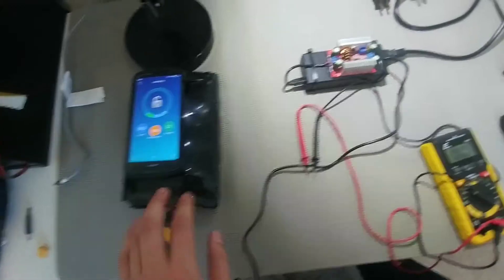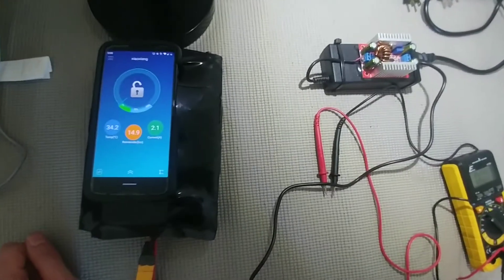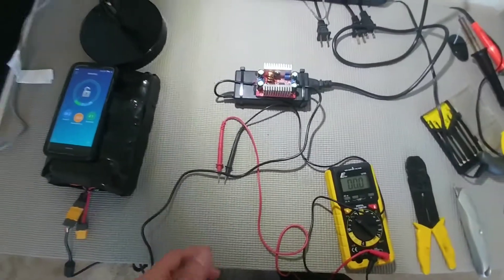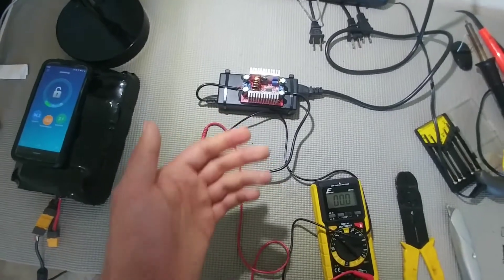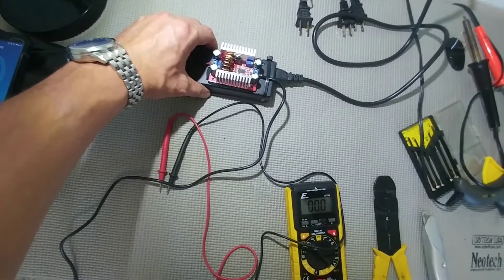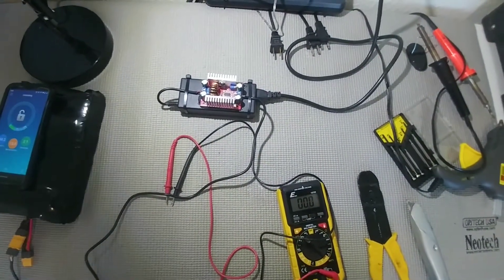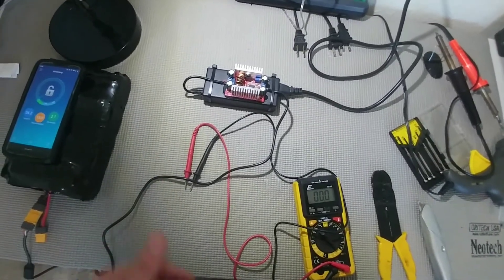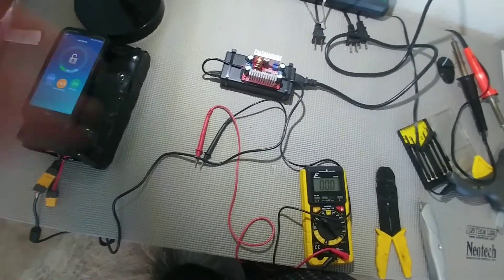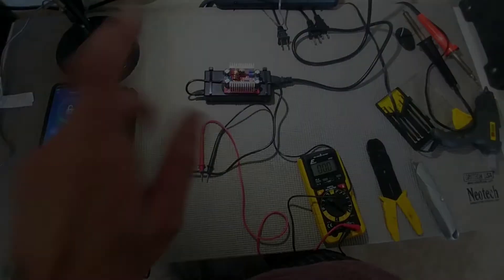So 2.1 amps flowing into the battery — and that's how you adjust it. If you plug it into a different battery you'll have to readjust everything, but this is perfect because you don't have to charge your cells all the way if you want to prolong their life. Thanks for watching guys — it's a pretty simple charger setup that takes just a few minutes to build. It's getting a little warm while charging but that's okay since we're running at about 80 watts. It could work for any kind of batteries — e-bikes, whatever batteries you use. Hope you enjoyed it and I'll see you in the next one, bye!